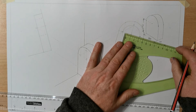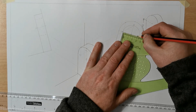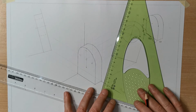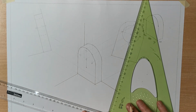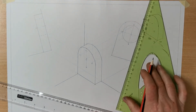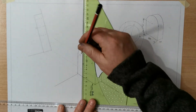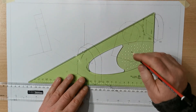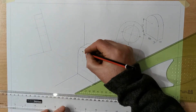What I'm going to do is go 15 to the left and 15 to the right and pick some more points. Project up and find out what the height of the hole is over at 15 left and right. There are the heights above and below that point. And the same thing here. That's on the center line. When I bring that down, it's there on the center line, and it's above and below that. The one above it is there, the one below it is here. So I know enough for half the curve.